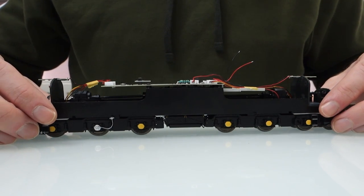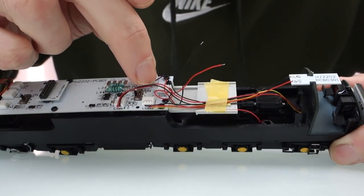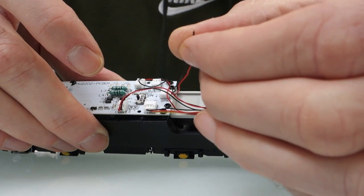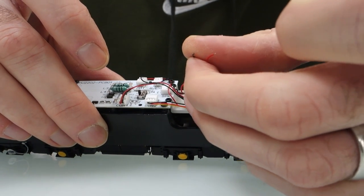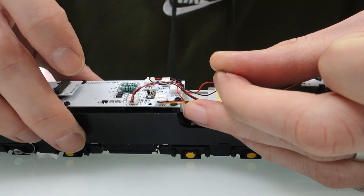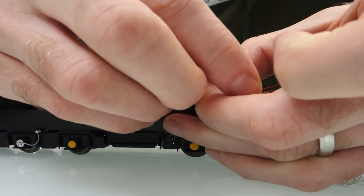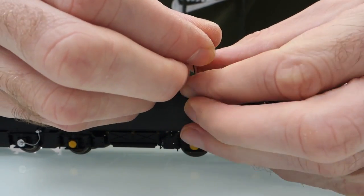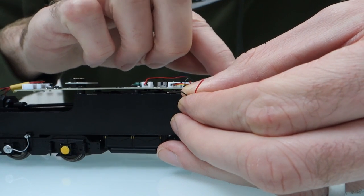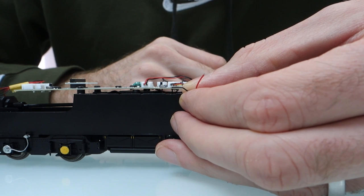Interestingly, one thing that I've found whilst I've been fitting the speakers is that you've got two speaker wires. So you've got a socket marked speaker here, and then you've got two wires which just go to nothing. So you'll be able to connect your speaker to those if you want, or you can just remove the plug and have it connected to the decoder, whichever you prefer. But if you are going to be not using these wires, just make sure that the ends of them don't touch anything or each other, because it might end up causing a short